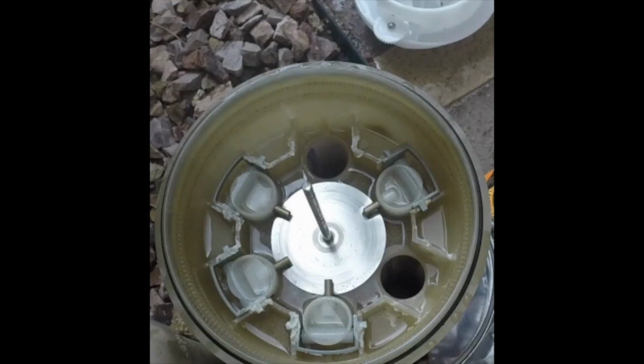So you've got the guts and gears out now, and you're going to see something that looks like this. Now, it might be a little bit different, but if you notice on the bottom there, there's all those little valve port covers. And all those holes are the feeds to the different sections or zones for your pool pop-up system. So the tricky part is identifying which one goes to the steps.